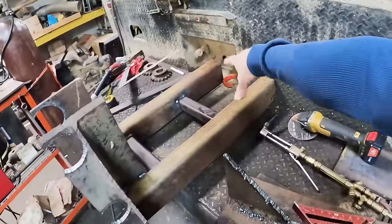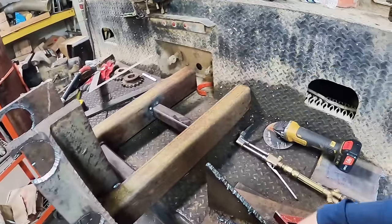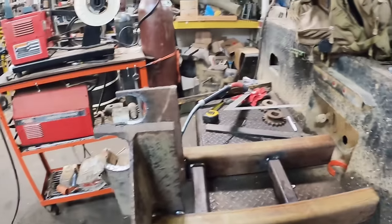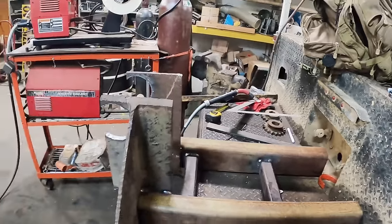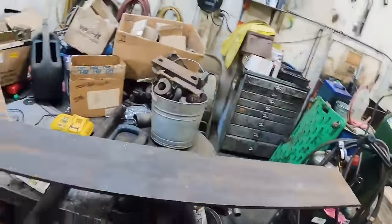Now we're gonna operate with flat bar for now. I'll get a cutting edge coming, but I don't want to spend much money right now. But before we get through mulch season, I'll get a cutting edge coming and put on it. For now, we're just gonna cut the slope on it, cut this piece in half, and then I'm gonna put both pieces on, because I want to be able to reach.